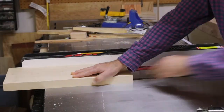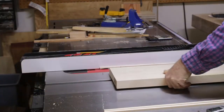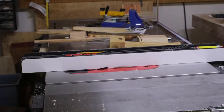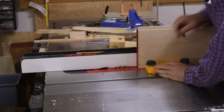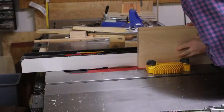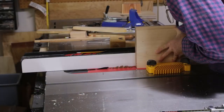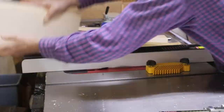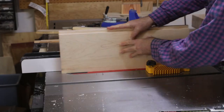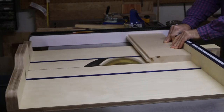These are the top boards and I'm making the tongue there. If you cut it on one side and then flip it 180 degrees and cut it on the other side, that way you'll get your tongue centered. Same thing with the grooves when I cut those. I didn't use a dado blade so I later came back and cut the center part out of the grooves.